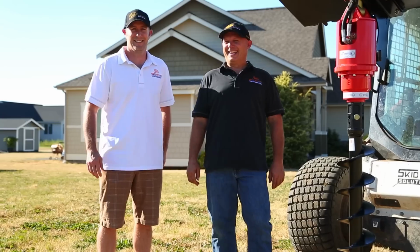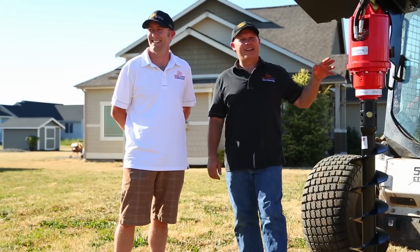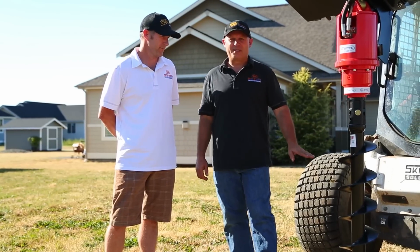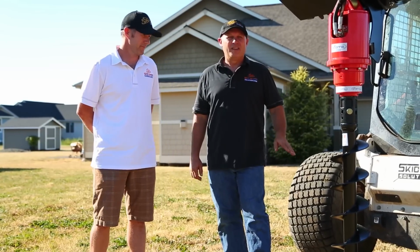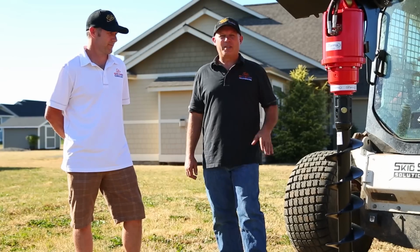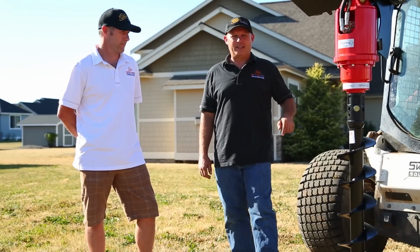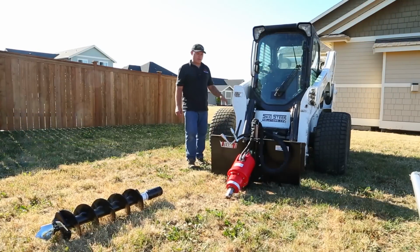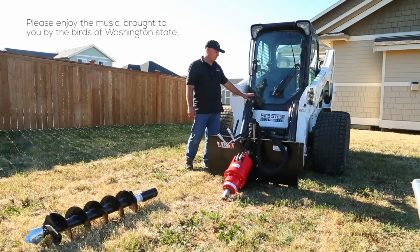Hi. So Craig's going to pop in and out of the video while we're shooting this, because what we're going to be doing is pre-drilling some holes through his neighbor's backyards. You'll see him popping in and out, guiding me along so I can hit the spot for where the posts are going to go. I'm going to do a quick run through on how to install an auger drive onto a skid steer.